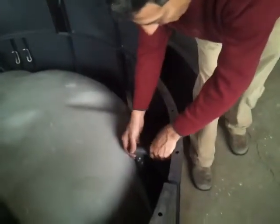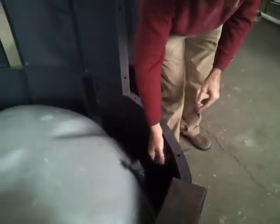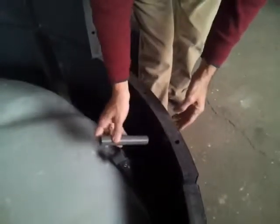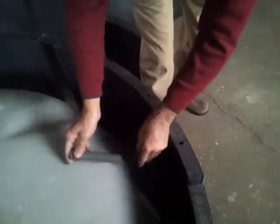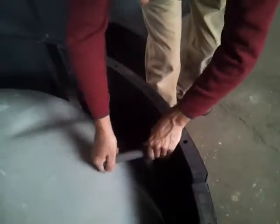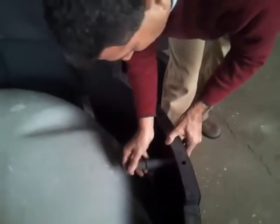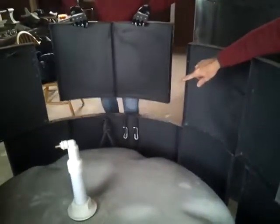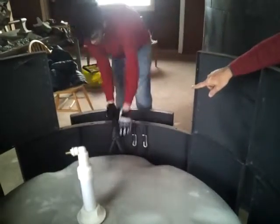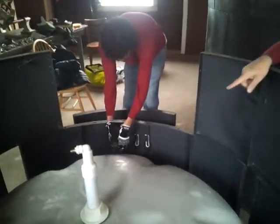Removing the top set of molds, you see this pin here. This pin is long enough that it goes through the hole that will be left in the cement. When you actually make the mold, you pour the cement over this and it leaves a hole that you can see how this can fit through. And then that anchors the holder on three sides — one here, and another one down there.